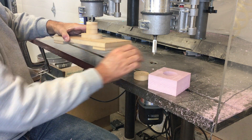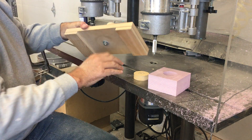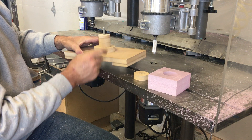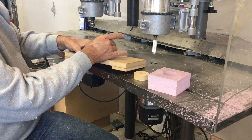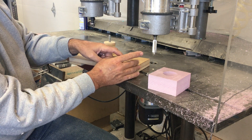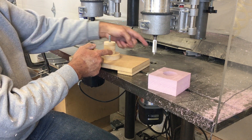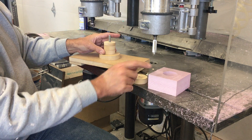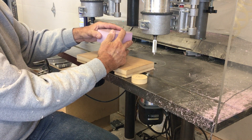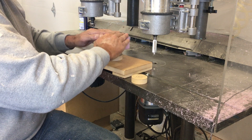Here's my machining fixture. There are a couple of operations: the first one is just going to rough out the blank for the cylinder — get the outside diameter cut — and there's also a feature on the top that I cut at the same time. These are just plugs that I started on the belt sander with a dowel, turned them to the diameter I wanted, then copied them by stacking and pattern cutting. I got a whole bunch of them and they fit nice and snugly on the inside of the bore — you can see it fits on there real nice.